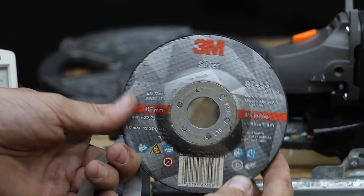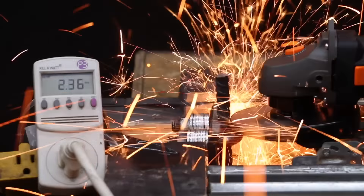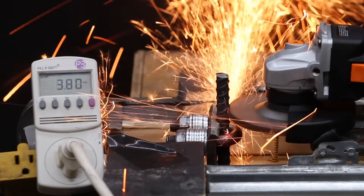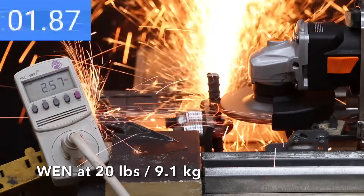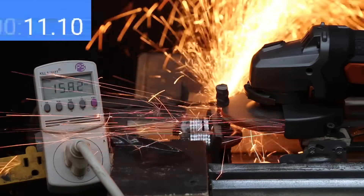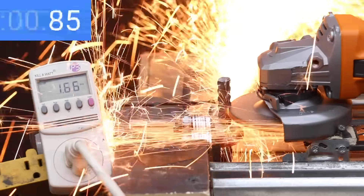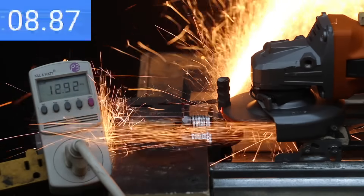Next is the maximum torque and working load test, cutting through rebar with a quarter-inch thick grinding wheel, with a new wheel on each grinder. For the low-amp grinders, starting with 10 pounds: the Warrior did fine with 10 pounds, but 15 pounds was too much and the Warrior started smoking. The Wind handled both 10 and 15 pounds, but with 20 pounds and a new grinding disc, it lost a lot of blade speed yet survived at 16.5 seconds. The Black & Decker also lost a lot of blade speed and finished 2 seconds faster than the Wind at 14.5 seconds. The Porter Cable performed well for a 6-amp motor at 15.2 seconds. The high-revving Ridgid made quick work of the rebar and took the lead, over 4 seconds faster than the Black & Decker at 10.4 seconds.